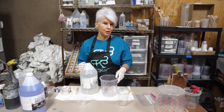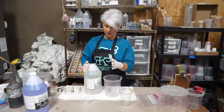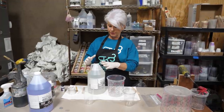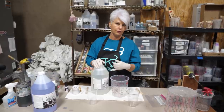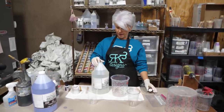We're going to do 52 ounces because I'm using three ounces per square foot. We're going to be using the Stone Coat Countertop Art Coat. The reason we're doing the Art Coat is because we're doing a white finish - the Art Coat has massive amounts of UV protection, and that's why we're going to use it.